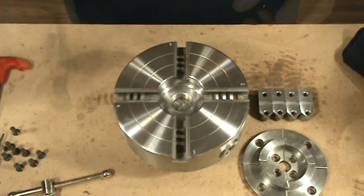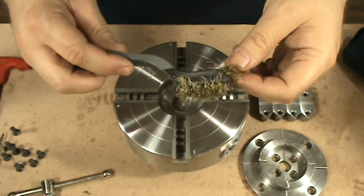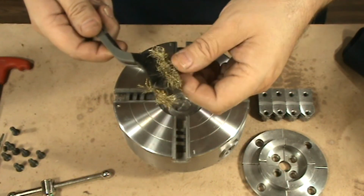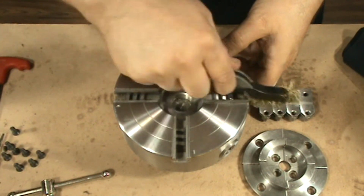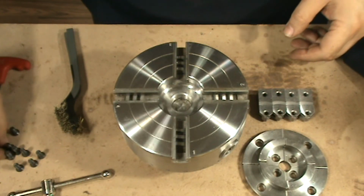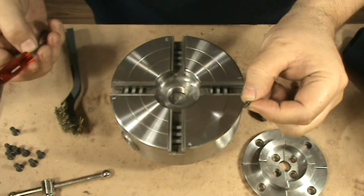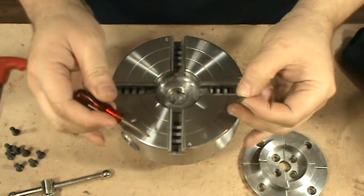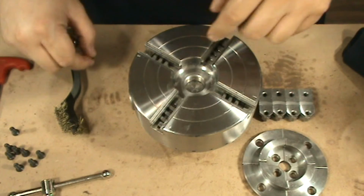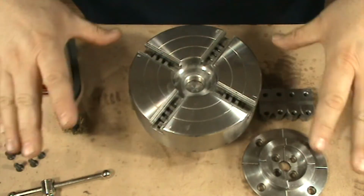Also to remove the dust and the rust that was too stuck, I use this bronze brush. Bronze is a metal that is softer than the steel, so it's safe to use it without damaging the steel. Okay, I had to remove this small screw from this point right there, to be able to remove these sliders from the rails. Otherwise, when you are using it, you have that to avoid them becoming undone.